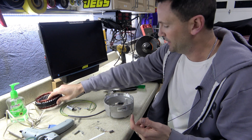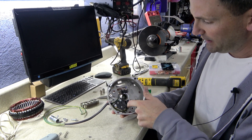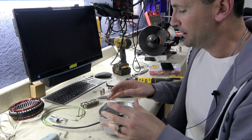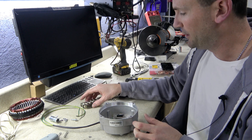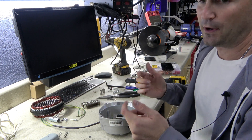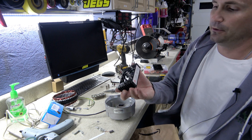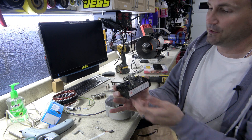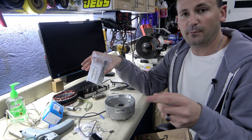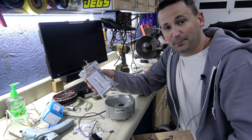The way we're going to make that actually work is — well, we're taking out the regulator. In fact, took out basically everything here. We're going to leave the brushes in there but wire them off individual leads so I can control them completely independent from the chassis. This will not be a grounded case anymore — we're just going to apply field voltage directly to the armature. We're going to take our three AC lines and run those out into a separate bridge rectifier. Because these are going to be doing constant duty, I upgraded to a much more substantial 100-amp unit. This gives us our three AC inputs, our two DC outputs. I also picked up a couple of displays that will give me voltage output and amperage so we can monitor what's coming out of both alternators. I think that'll work, but we'll put that in last — we've got to get this thing working first before we make it neat.